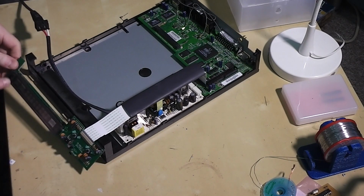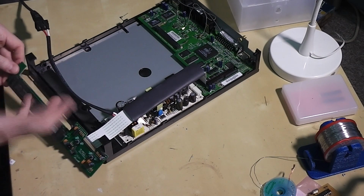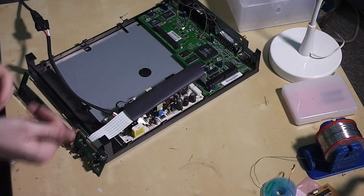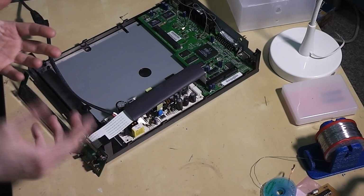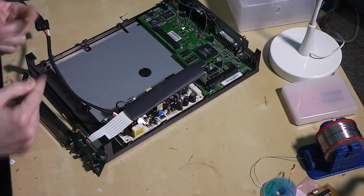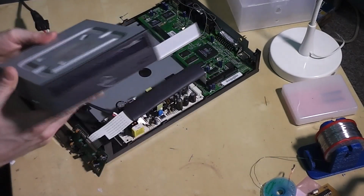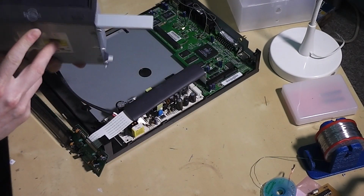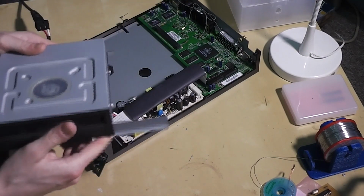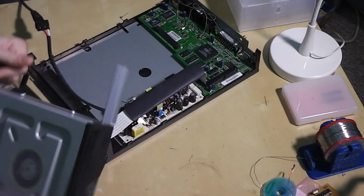The display itself was very, very bright. I'll power it on in a moment and see if you can see it on camera. It's possible it was getting too much power and glowing way too brightly, and the overvoltage would explain that. It would also explain the failure in this thing. If more than 12 volts was being pumped into this device, then one of the chips could have just reached the end of its tether one day and blown. So that explains why I think it's gone.